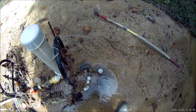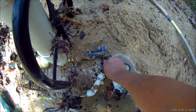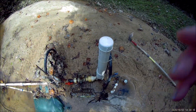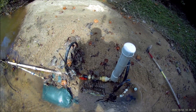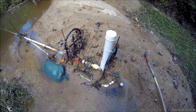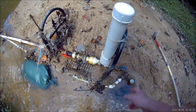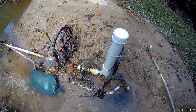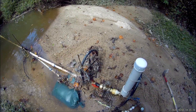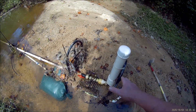Pressure's up a little bit above 40 PSI, so I'm going to turn that off and open up my delivery line. Let's go up to the house and see if any water's coming up that delivery line yet. It ain't a pretty pump, but it's functional. This is a log crib that I used last winter, but this spring I brought it down here to the creek. I use it for protection against logs and other stuff that might come roaring out during these flash floods, and so far it's been working pretty good — I've had zero damage in five months to the pump itself.